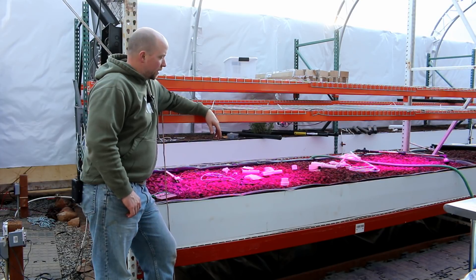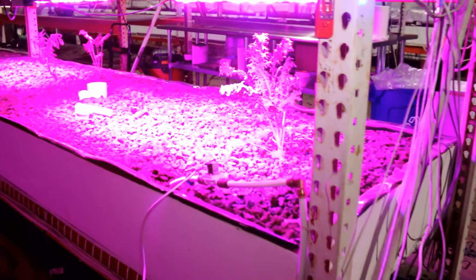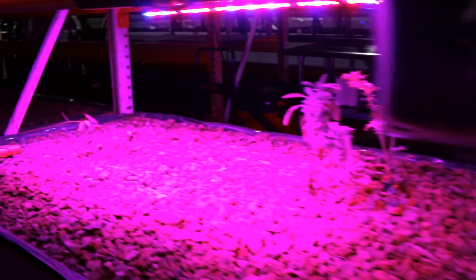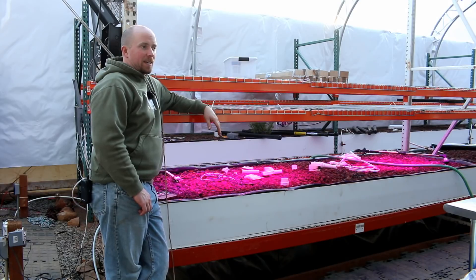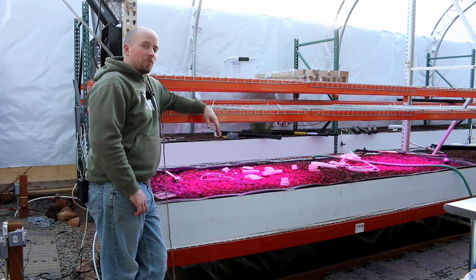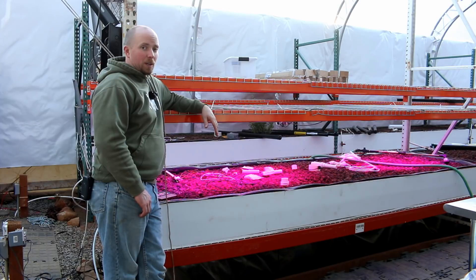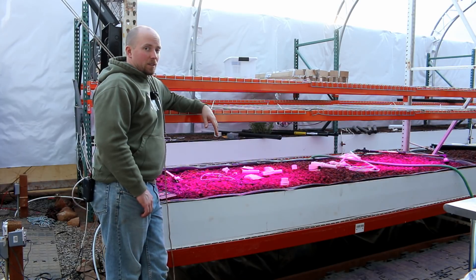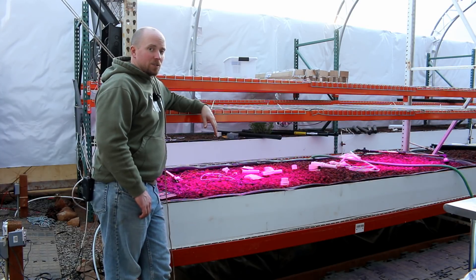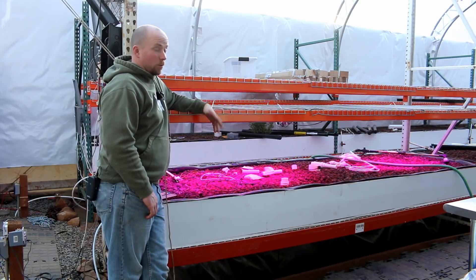You might be wondering why these lights look purplish and pinkish rather than normal white lights. Well, we have a limited amount of electricity out here — 40 amps for this entire building. We can up it to 80 but that would take power away from Hab 2, since we only have 80 amps available for the entire construction site. So we went with 40 amps, which led us down the path of finding the least energy-consuming light option that actually works.